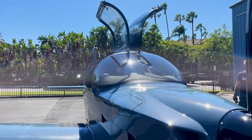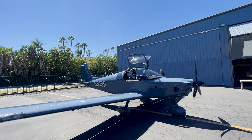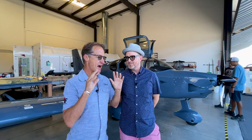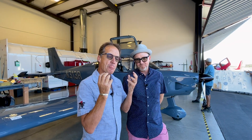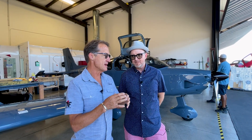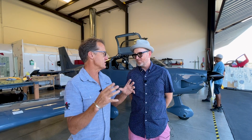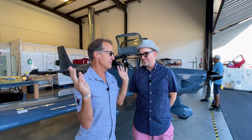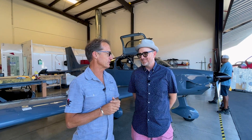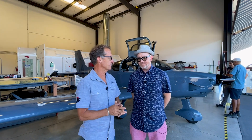This aeroplane has got very advanced avionics. For everything to work, one of the things that has to be done before everything finally sings in unison is the magnetometer — which is what in an old aeroplane would be a compass. This is the magnetometer that tells you which direction you fly. We've got to go out and calibrate that for the installation of the aeroplane, and once we've done that everything suddenly starts working. So: radio check, taxi, magnetometer calibration, and then we'll check everything else as we taxi back. We'll do everything except fly.